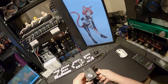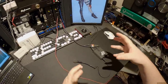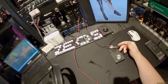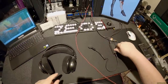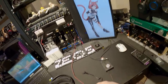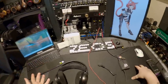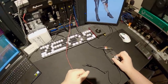If I unplug this and plug it in here — one of the other things when you get a unit this small and simple — this is now controlling the volume of the headphone. The variable output goes to another headphone amplifier. Previous Fullas had a variable output and a fixed output, so you could hook up to another amp with its own volume control — that was very unique — and it's gone now. But this allows you to have a 3.5mm input, so you can use it as a USB DAC or feed the source from something else — plug in, it'll override — and it's a solid experience.